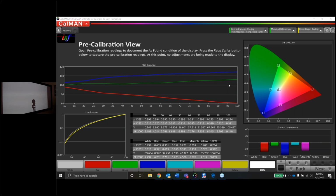I have thought about doing maybe some black cloth behind the screen like I did in the bedroom, but considering the room isn't pitch black and the walls are white, even though the room's fairly dark, I'm probably going to go with a 2.2 gamma on this one. If the room was pitch black and I had dark walls and no windows at all, or maybe it's nighttime only and I can't see my hand in front of my face, then I'd probably stick with something like a 2.4.